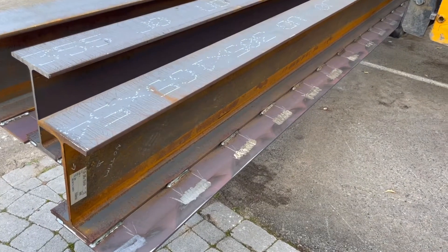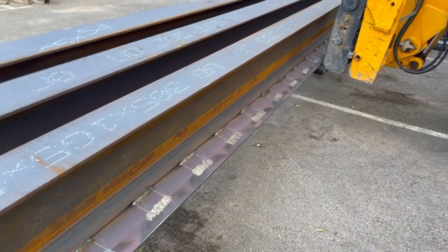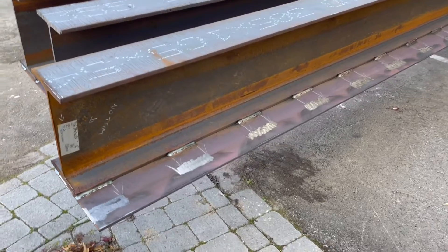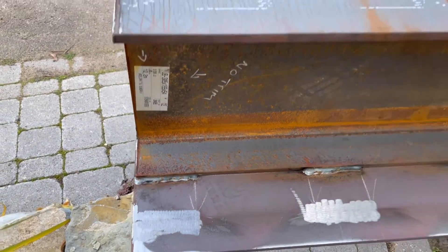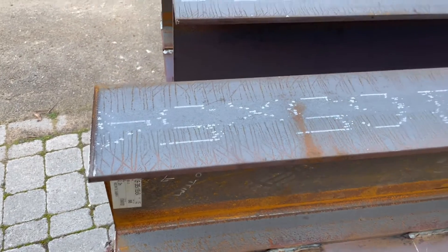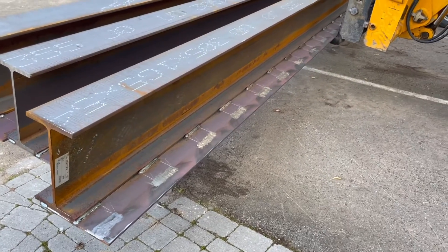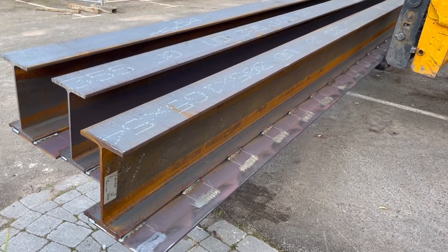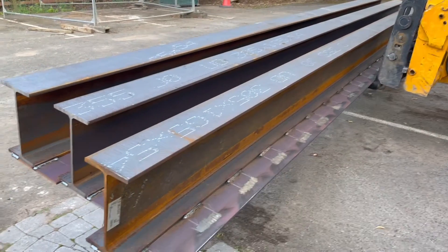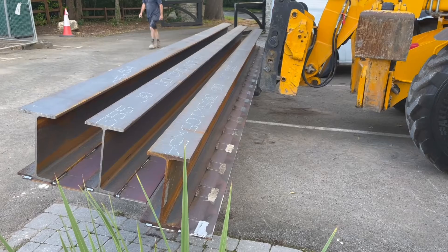As you can see with these steels, we've not only got the I-beam plate welded at the bottom — it goes all the way along. The blockwork sits on the front face and also sits on top of the I-beam, and that's how it's designed. You get the structural strength but also the continuity, making sure the garage looks seamless and you won't even see the steels or the plate. That's the reason we use those type of steels. We've got two more to arrive for the centre beams.